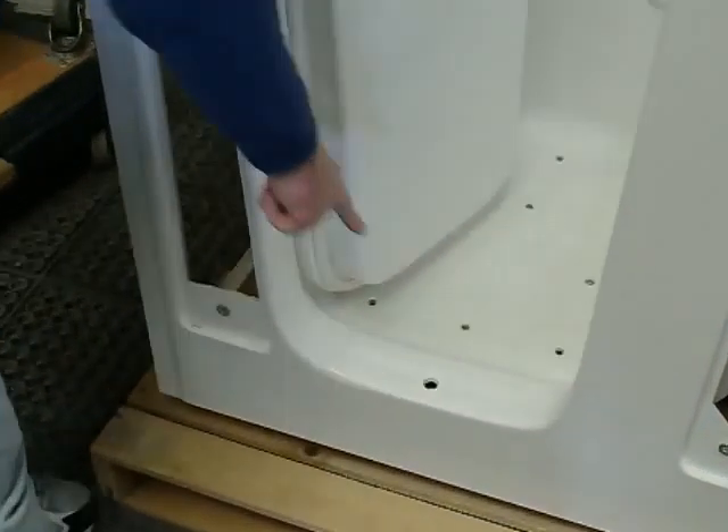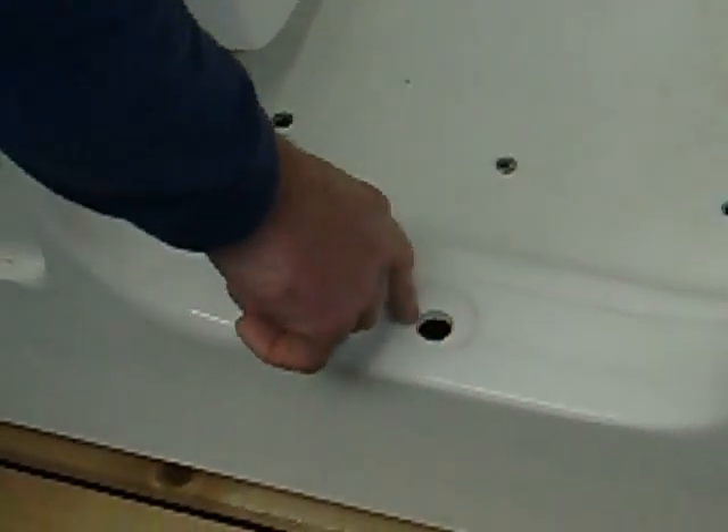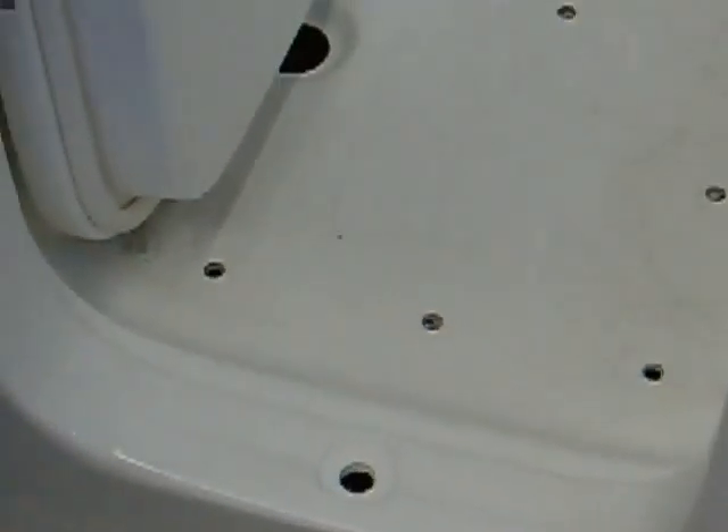The door drain is a specific door drain that we do get from Waterway. I need to talk to you about the frame underneath — the frame cannot be too close to this door drain. Since we're going to be putting wood in the floor and the seat of the tub, that should raise the tub up off the frame enough so we don't have any clearance issues. Right now with this tub from Hydro Systems we actually have to grind on the back side to make this door drain work.